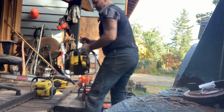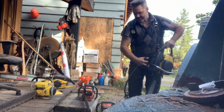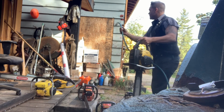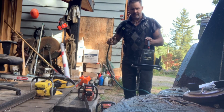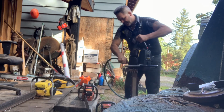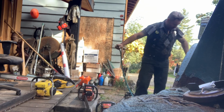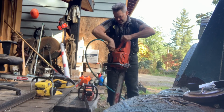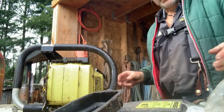Friends, if you want to cut down on problems you might run into with power saws, just blow the sons of guns out. Just get home. Don't put them away dirty, especially if it rained a bit. Just blow them out, especially in the starter. Blow your saws out, friends. I know you're tired when you get home. Tree guys, you know that. Just take a second, blow them out. All that gum and stuff sits in there. It's going to create problems down the road, especially in the fins, it'll start heating up. Blow them out.